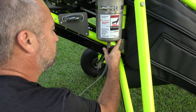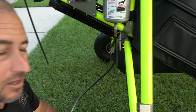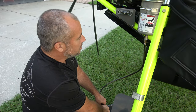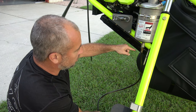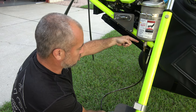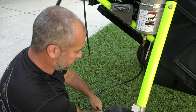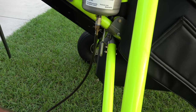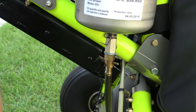And then we're gonna just drain all the oil out. If you don't have one of these on your aircraft, you need to get one. This is a whole lot easier than having to cut safety wire, replace a crush washer, then torque it again, re-safety wire it. It's just this quick. So this will take a few minutes and we're gonna just let that lay right there.